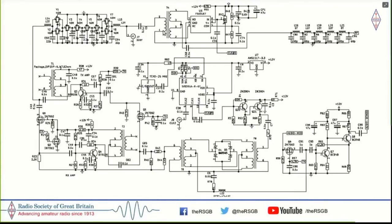So it upconverts to 40. You have a 40 megahertz crystal filter here. And this crystal filter actually uses two crystals, two parallel crystals at the end. And this is also due to Dr. Gordon. He calls it a QER filter, quasi-equiripple filter. This makes the tops very flat. And this basically feeds to a bidirectional IF amplifier. I have not used resistors here in the collector loads, but instead opted for transformers built on FT37-43 toroids. And the reason for that is that we need much higher current standing in these transistors to be able to handle the higher dynamic range.